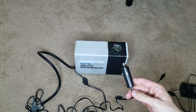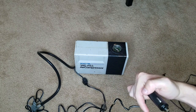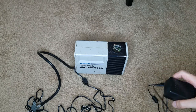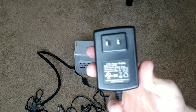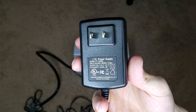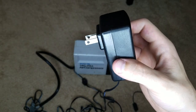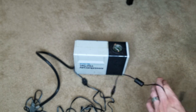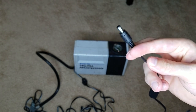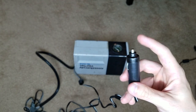There is a product you can use that they make pre-made — I'm sure they're from China. You plug this into a socket that goes directly into the wall; I'll link that down below if you want to do the cheater way. But I will link this which I got on Amazon for a few dollars. Basically what this is: I got it as close to the specifications as possible that a cigarette lighter would be — this is 12 volt 2 amp, pretty much what a normal cigarette lighter would be. So it takes all that magical electricity from the wall, tones it down a little bit, goes down the cord, and into whatever this would charge. I think this is like for security cameras, but I'm gonna chop this off and get the positive and the negative from here and connect it onto the cigarette lighter.